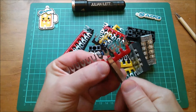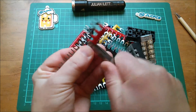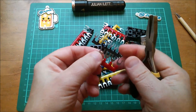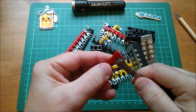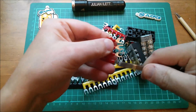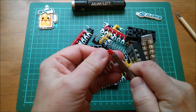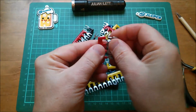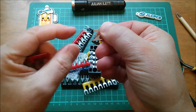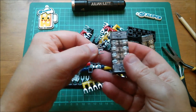So let's break these off — if you waggle them a few times they break. Oh, these are quite resilient to that. Yeah, that took a lot of waggling. Then typically I'll take out two of these like that. And I do use these because I'll put a blob of solder on the end, solder my wires onto them, and they work as wire ends that go into these terminal blocks.